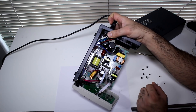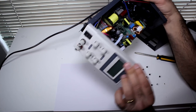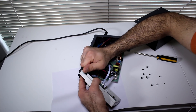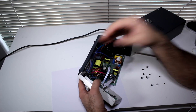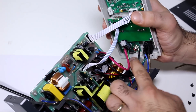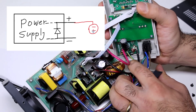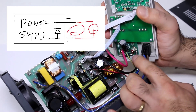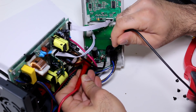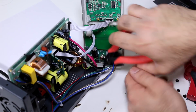This area is where all the power conversion happens, and these circuits here are the controllers and the display. You see that the outputs are connected here, and I can see a diode across the output. So this means that if I connect the output backwards, this diode will conduct high current. Maybe it's blown. Let's check the continuity on the output. Yep, that's short.